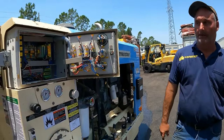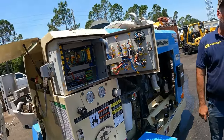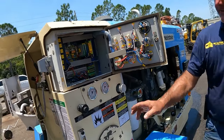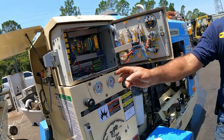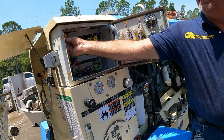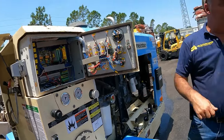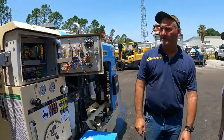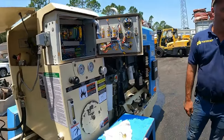Okay. And then there's a couple of them. The 30 is not going to be used until you hook your vibrator up, and then that's used. And then you're going to put these two plugs together, here to here. You'll put these two together, and that'll initiate, and your switch will be here. So you just cut that off, put some connectors on it, and then put your micro switch on. Boom, that's that. And then your main power feed for the vibrator is going to come in through here, and then you plug it in here. That's it.